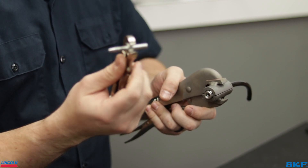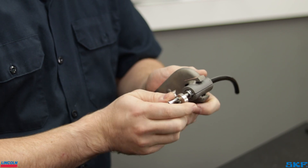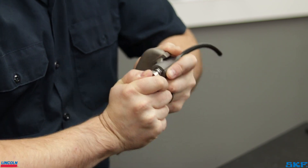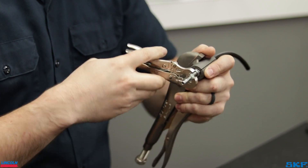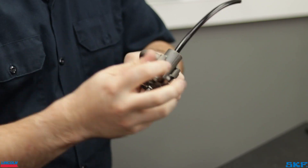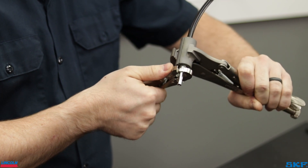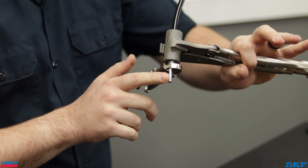Now this is the reason why I locked it into this configuration. You're going to press the tapered end of the hose stud into the end of the hose, which is going to widen the end of that hose, while at the same time locking it into those threads. Now once you get to the end and feel them firm up like that, stop — you don't need to torque it any further or else you risk breaking off the stud.